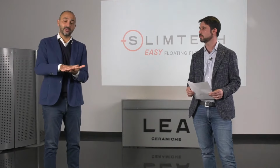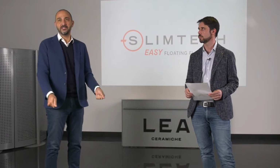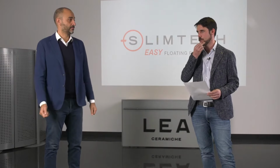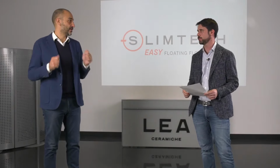How long does the mat last? And it can be reused after removing the floor. This is a key point, because it allows us to focus on the fact that there is no adhesive on top of the mat. If there was adhesive, once the adhesive is cured, it becomes dried and it cannot be reused. But the physical characteristics of the mat that provide grip don't change. So if I'm doing a laying and I decide in a number of years to remove and install other tiles, other slabs, I can do it without any problem because the characteristics are the same over time. They don't change. So we invest only once in the mat, and then everything is possible, even if you want to renovate the floor.